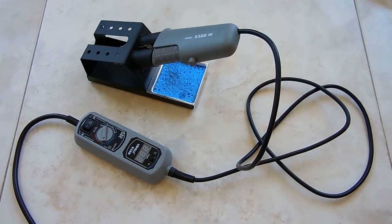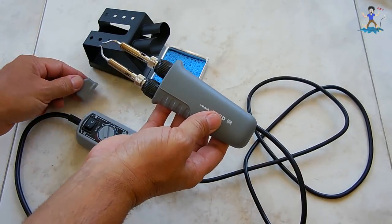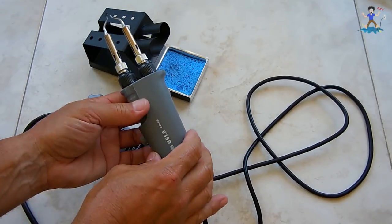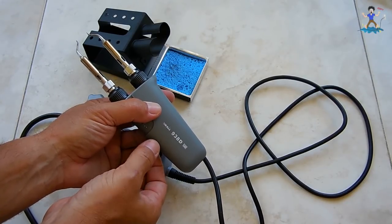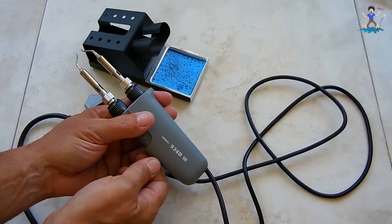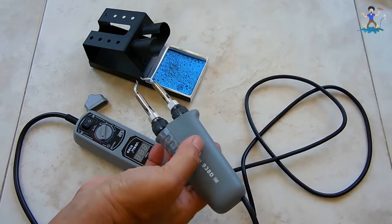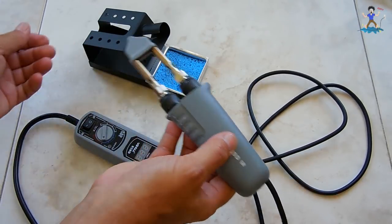Now you're looking at the soldering tweezers, which I use for desoldering surface-mounted components. Nice metal holder. Protective cap when not in use. Two heating elements with the curved tips. And what this knob does is it adjusts the spacing. All right, that's maximum when it gets loose. And then you can squeeze and hold things. So what I did is I adjusted the correct spacing for my tactile switch like that. And I just used the two together at the same time. Loosen this up just a hair. Put that back on.